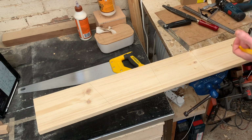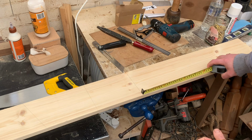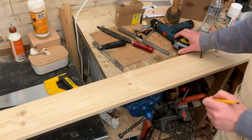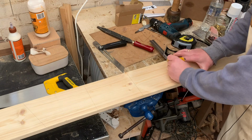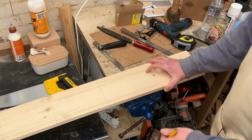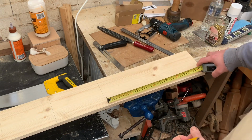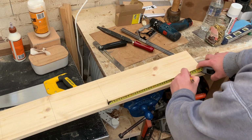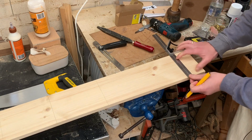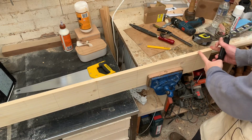Like that. Then we have the roof, which is a little bit longer at 210. This is because it's got a little bit of an overlap on the front to give the bird some shelter as it stands in the hole. And then we want the backboard, which is 350, going up to there, marking off like that. And then this last little section along here is the base of the box. So the small section is square at the bottom.